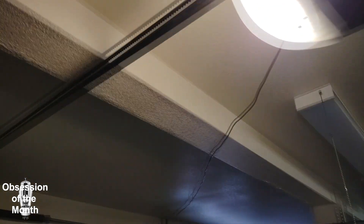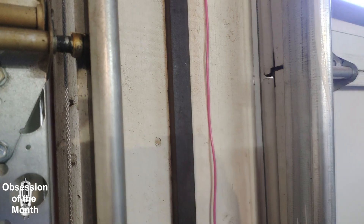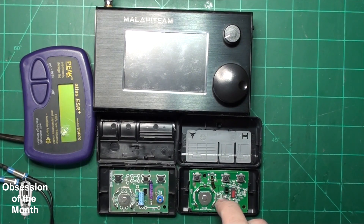The final thing that really helped was moving the antenna from where it dangled down from the opener over to right up against the wall between the two garage doors. Once I did that, I was able to open the garage door from 145 feet away with the older remote, 154 feet with the newer 953EVP2, and 177 feet from the Homelink in my car — that's two houses down. I hope this information helps. This was a big pain, but most people would have just replaced the unit by now. I'm a little more persistent than that.